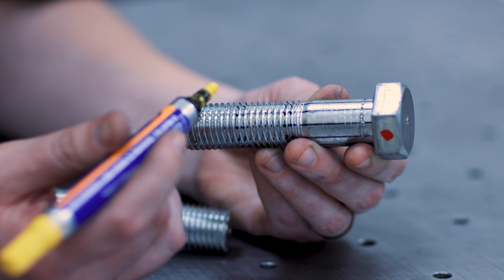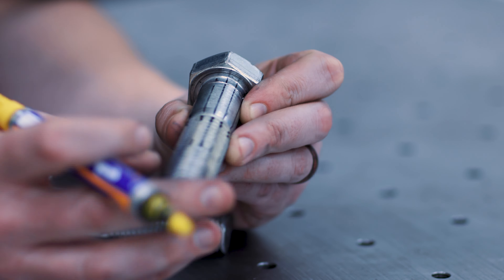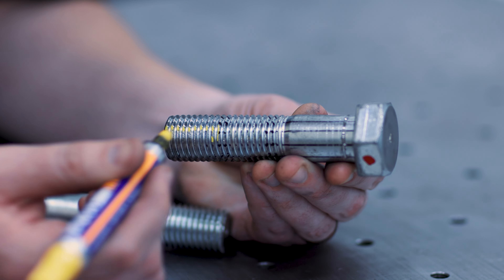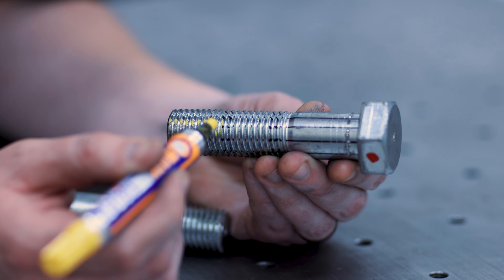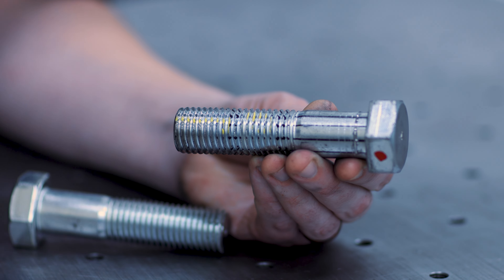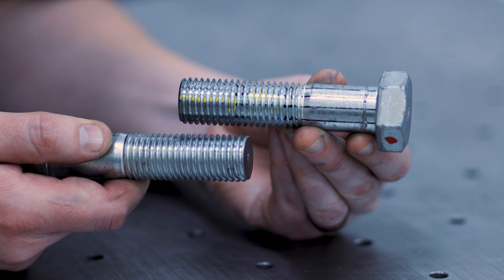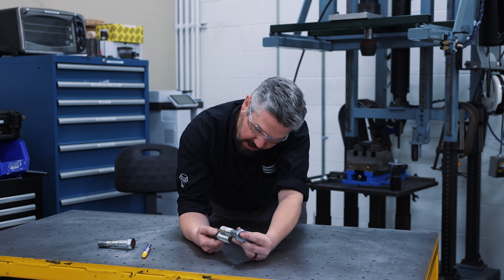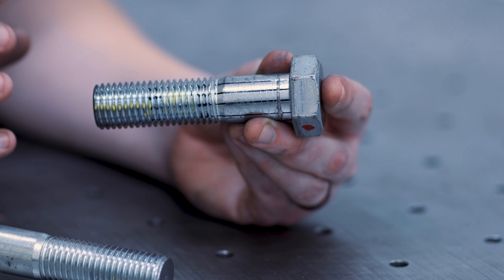I can't see any twisting of these lines. It looks straight on and I can't even make a measurement with my angle gauge. But what we can pick up is that this bolt has been yielded in tension. If we look at the zone where the threads are engaged, from about this spot here, the threads are going to be pretty uniform. Where this bolt is going to yield in tension is a few threads beyond that first engaged thread — so it's going to yield in this range right here. You can check for that by using an unyielded bolt as a thread gauge. It should mesh up perfectly here, but as you move the bolt up, you're going to pick up a spot where the bolt threads no longer mesh. Right there — that tells me that in that spot we've over-tightened this bolt and taken it well beyond its elastic limit.